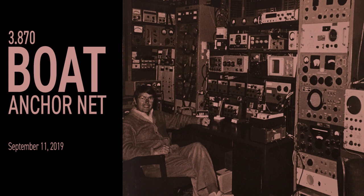No, I'm not barefooted. But we're trying to figure out how to get a little bit more drive out of this. I turned it up even more. Did this help any, Rusty? Okay, I got you now. I had the RF gain turned back too far. Okay, well, I've got about 150 watts going out here, maybe 175, something like that.